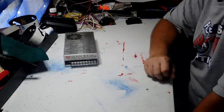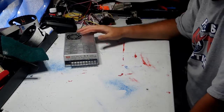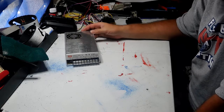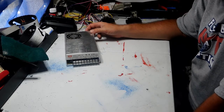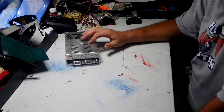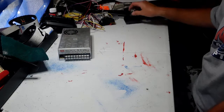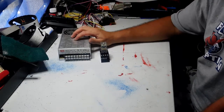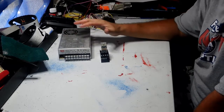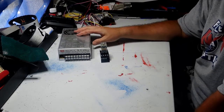You can plug in the back of your radio, or maybe you can put an extension cord on it, or however you decide to design your system. But they work really, really great. But the thing is, if you're going to have this and batteries in the same thing, you're going to have to use a relay or some sort of a switch, because the power supply and the batteries have to stay separate, even though they're both powering your car radio.